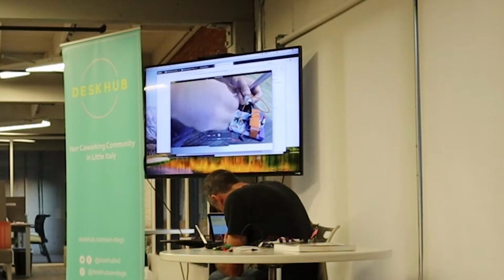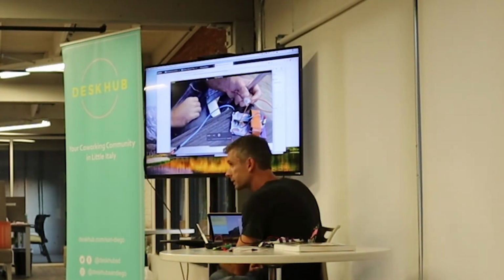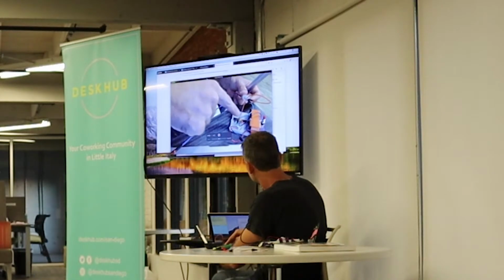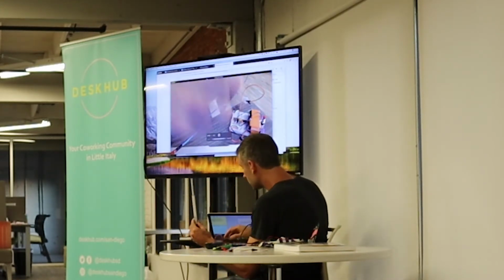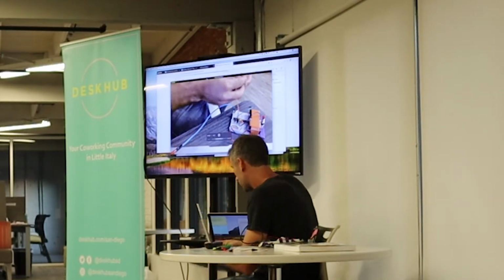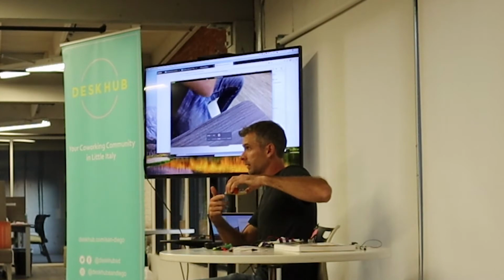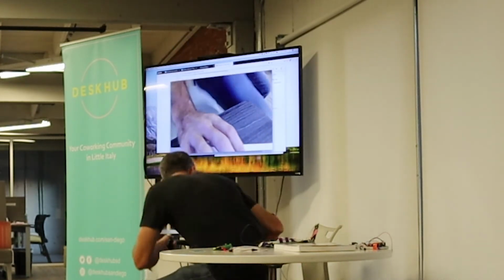So another thing about voltage is it's a pain in the butt because this IC actually wants 5 volts for power, but the motor wants 9 volts. So I've got this 5-volt power supply. I'll explain a little bit more about how you get power, some of your options there. The 5-volt power is going to the IC and the hex inverter, and then the 9 volts is going to this motor. So here this thing is extending, and then if you press this button, it retracts. This is all happening through the H-bridge, but what's really great is that you don't have to make a really complicated circuit, and you don't have to unplug everything manually. It ends up being really simple, and you can drive, like we did here, the 9 volts separate from the logic that's happening.